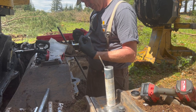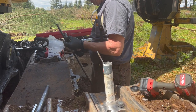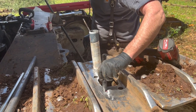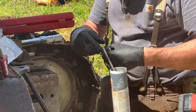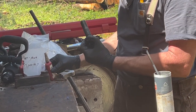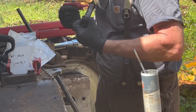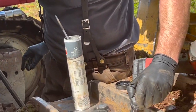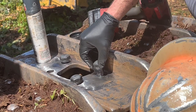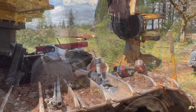I can't think and talk and work at the same time. What I was trying to say is I'm lubing up with grease the mating surface of the bolt to reduce any friction. The thing about torque-to-yield is it's like a physical measurement - it's not actually torque-based. That's why it's okay to use Loctite, which is a lubricant, and to reduce friction with grease under the mating surface of the bolt. It doesn't affect the torque because it's a physical measurement of the amount of rotation on the threads. That's a really cool thing and I like to think it's going to hold together.